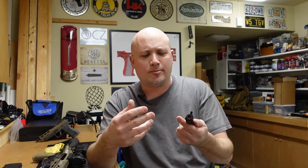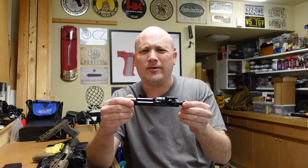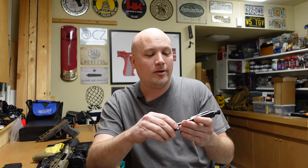So what is the advantage to a bolt carrier like this? When you're running a gun suppressed, you get a lot more back pressure, and sometimes that can cause problems with reliability and premature wear on your AR. Plus, having so much gas coming back into your face — you can definitely smell it and feel it, and sometimes it's going to make your eyes burn. So if you can tap off some of that gas before it comes back into the carrier, and the gun still cycles reliably, it can give you a much more pleasant and reliable shooting experience.